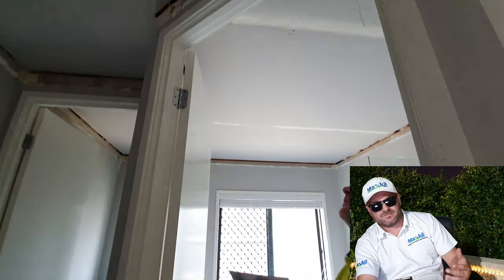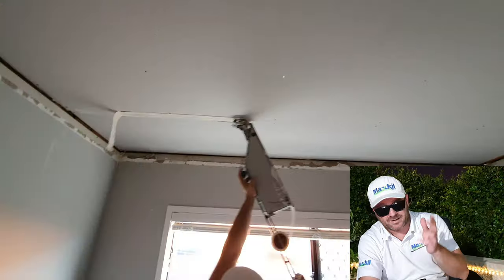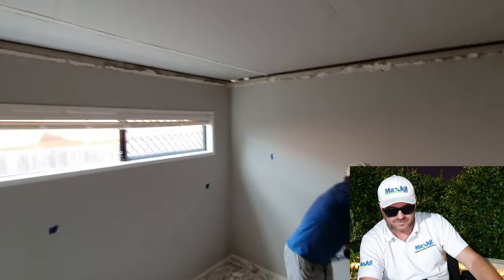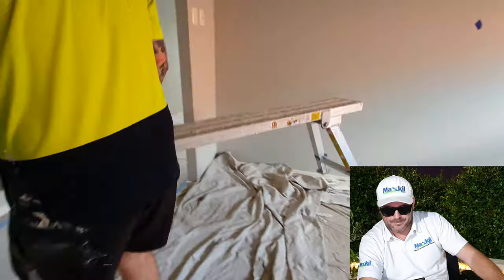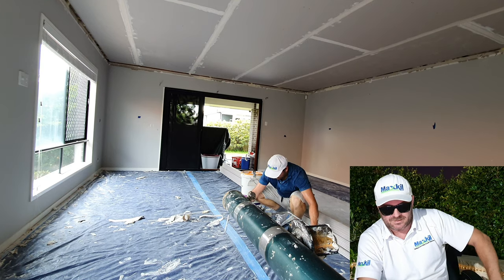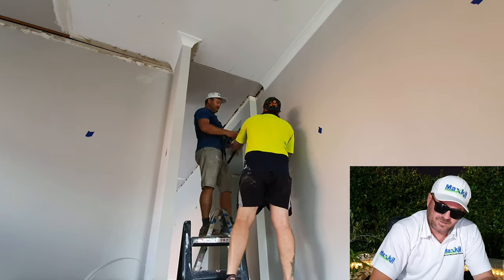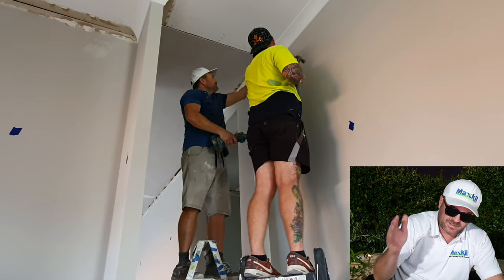I know how strong it is because I ripped that corner. I ran out of mud, it didn't stick, and the tape should have fallen down, so I had to fill it up and do it again. I'm starting to find it easier — when you have a nice open joint, it's nice and easy. This is the point where the mud starts to go off. The wheels on the taper wouldn't spin anymore — just getting clogged up. So we cleaned the box out and we're back at the expansion joint.